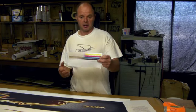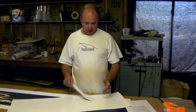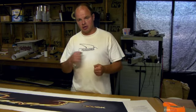And really what's happening when we've got that material right against our piece of plastic, instead of just going off into the air, it's going directly into the plastic. And the pores of the plastic allow it to penetrate, and the ink becomes a permanent part of that plastic once it cools. And it actually goes very deep into the plastic, so when you scratch the top sheet, you don't remove the graphic, you just put a little scratch in the surface.